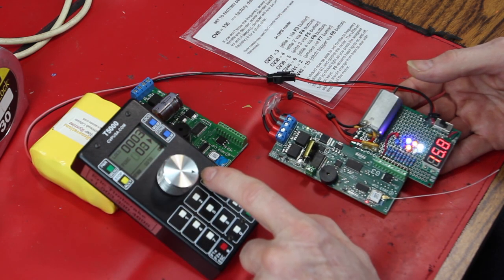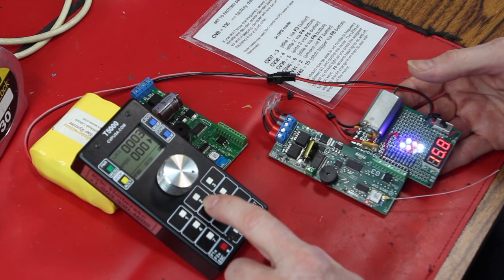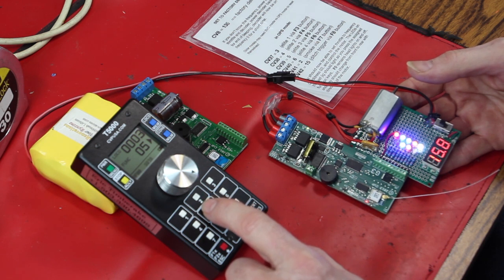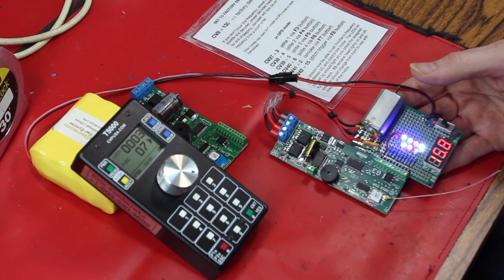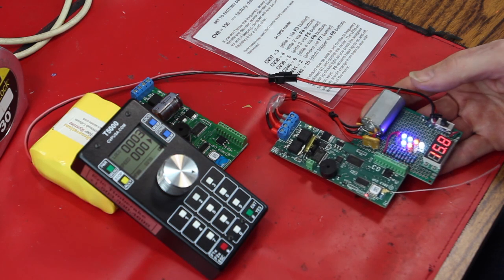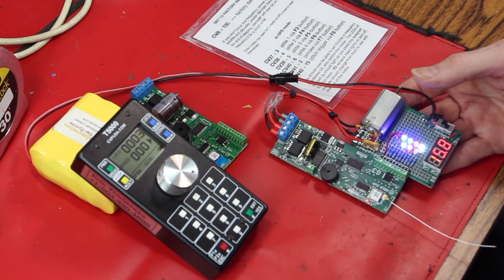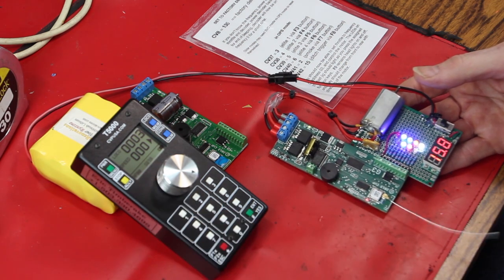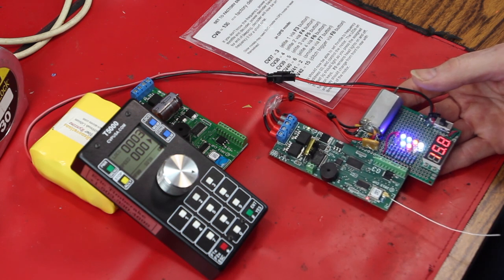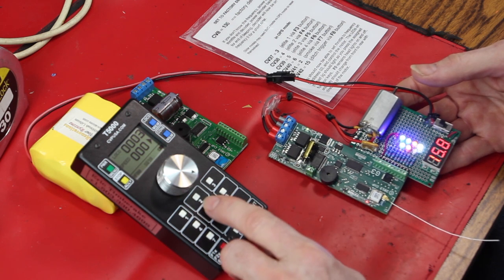Function 3 should turn on Elite 1, function 4 should turn on Elite 2, function 5 should turn on Elite 3, Elite 3. Oh, I've seen this before. Turn that off. The Airwire stuff sometimes mixes up function keys, and I've seen this on all my stuff, and I see it on these test boards as well. I think it had something to do with my transmitter, throttle is really close to the antenna, and it's really not designed to work right next to it. It needs a little bit of distance, so there could be some confusion going on here. But at any rate, moving on.